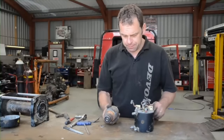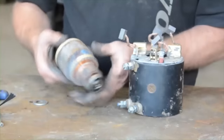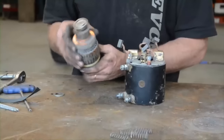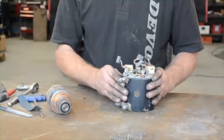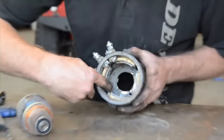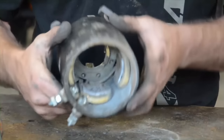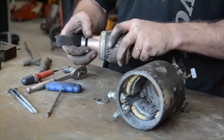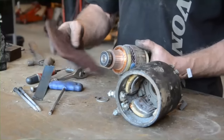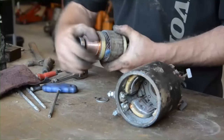What I need to do is clean this up. I'm going to take this part and use a piece of emery tape to clean the armature up and clean this rust off. I'll be using an airline — you can use a compressor or whatever to blow out all the dust on this part, then inspect it to make sure it's okay. Same with the brushes — cleaning all these off with emery tape, blowing it out with the airline, and also cleaning up these magnets, scraping out all this loose stuff and giving it a good blow out. What I go over it with afterwards is what they call Scotch-Brite, which is a bodywork thing really but does a perfect job on stuff like this — just cleans and smooths it up nicely.